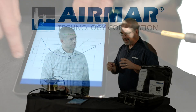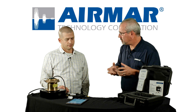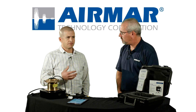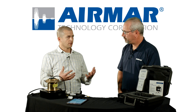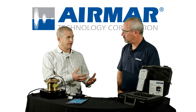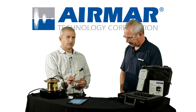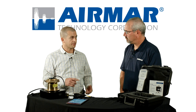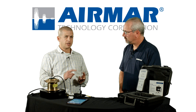So Joe, let's say I've run my test and I'm getting an out-of-range result. Why might that happen? The first thing we tell people: does it make sense? Does it follow the complaint you're getting? If you're getting poor depth performance on the 50 kHz side and you see a failure on the 50 kHz in SensorCheck, that makes sense. But if the customer's not complaining about anything and you're still seeing poor results, we have troubleshooting steps. First, do you have the right cable? We use a lot of the same connectors across different products and manufacturers. Make sure you have the right cable. If you're using the breakout box, confirm everything is plugged in correctly and you're getting good connectivity.